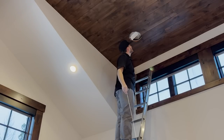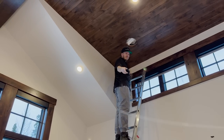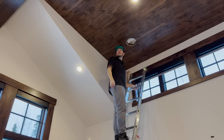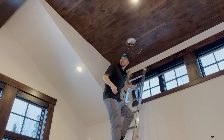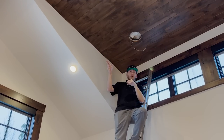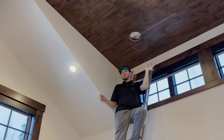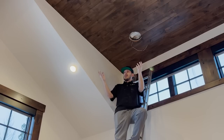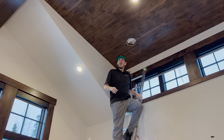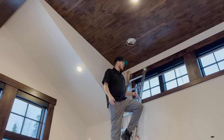A little bit of patience and it looks like I got it — the fish hook really paid off. That was one of the most difficult aspects of this installation. The next ones I'm just shooting the line from one speaker hole to the other — same thing on each. Those should run straight down, and there's attic space up in there, so I'll use my phone and camera to look in and see what's going on, which should make it easier.